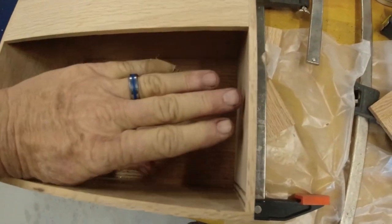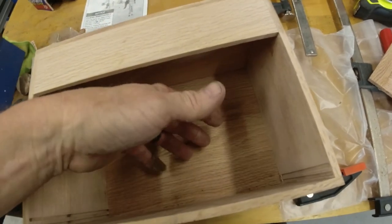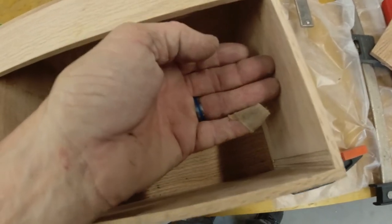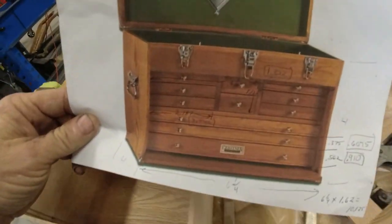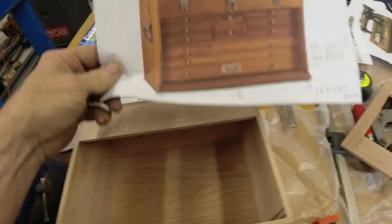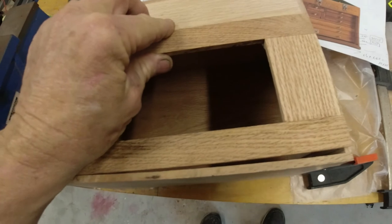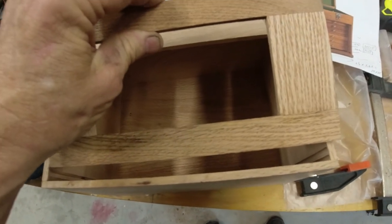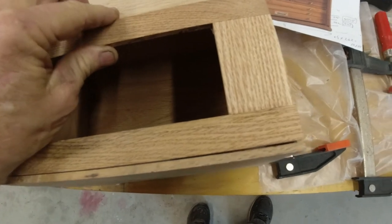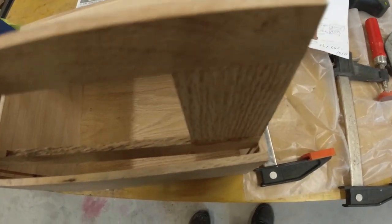What I'm working on right now is an insert that goes in the front. I've got to keep this open in the back for the ashes, so I can't have actual drawers - I'm going to have false drawers that will just look like drawers. I want it to look like that when the front door covers this. I still got to finish sanding it, put a router out and put an insert in it so it'll be a solid door that covers these and it'll fold down and slide inside.